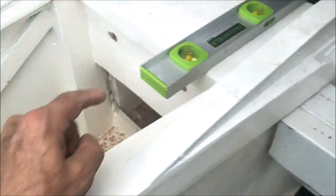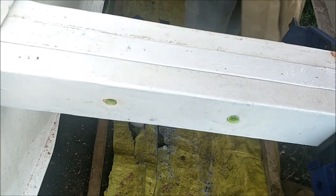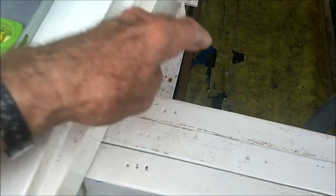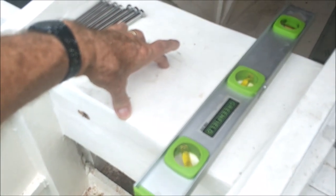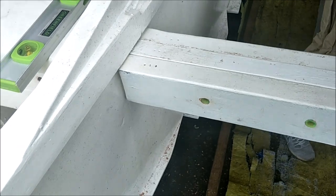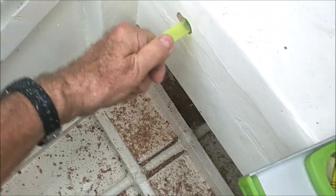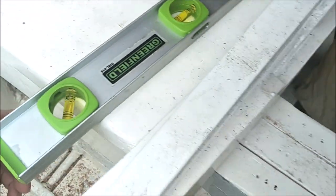These take longer tubes on here. This side here takes longer tubes because it's actually three 2x4s thick, solid here, and then the one removable here. So we've got to have a long tube for the three 2x4s. That's 4.5 inches long, roughly. I'll make it four because it's 1/4 inch on each end. So here, these are the roughly 4-inch tubes. Stick them in here like that, and that goes through the three.